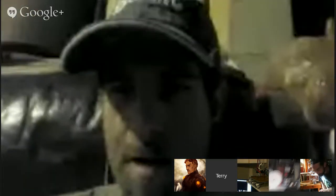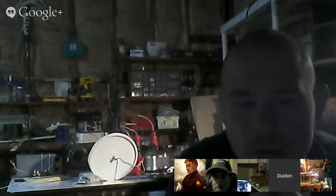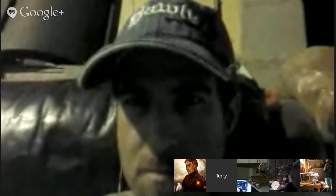The oil in the water line needs to be the same in the bottles and around the bottles. Yeah, the water line was the same, and the oil line was above the bottles because it kept arcing through the oil without it. It's a 50 here. This is my new power supply. This is why I'm having problems, because it's a 15 kV NST. All right, big brick of an NST.